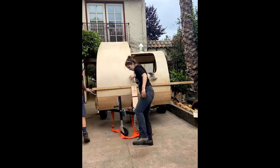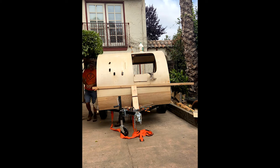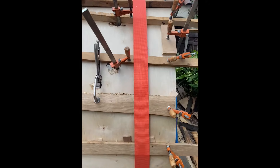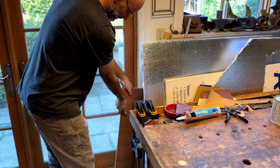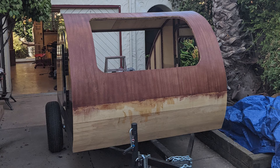Next step was bending the plywood and Sapelli over the front, back, and top of the trailer. Because of how steeply our teardrop curved, we layered two pieces of thinner one eighth inch plywood. We glued and screwed the first piece into the metal frame, and then glued the additional piece on top using ratcheting straps, clamps, and random pieces of wood to hold everything down while the glue dried. At this point, the trailer was actually starting to look a lot like our sketches, which was really exciting. We then applied a Sapelli veneer over top of all of that plywood using the same method. Once the Sapelli veneer had dried, we quickly realized it was a slightly lighter color than the Sapelli we had gotten for the sides, so to remedy this we put a stain over top of it.